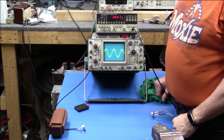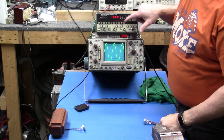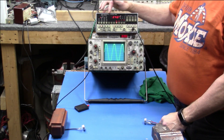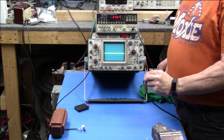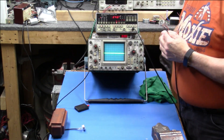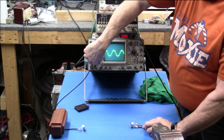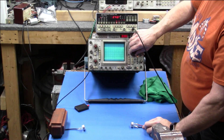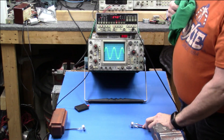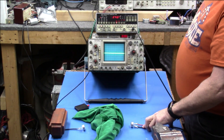Okay, magic hands are back. What we have here is a 24 kilohertz signal driving one of these transducers. This is the transmit — the one over here is the receive. I'm driving it with a sine wave, so you're going to see a sine wave at 24 kilohertz represented here on the scope. I'll put a rag in between — ultrasonic frequencies don't penetrate through very soft materials very well. So we'll put a rag in the middle and essentially completely absorb that energy.